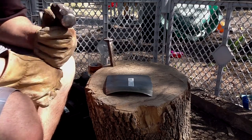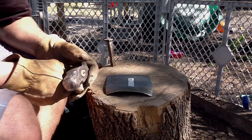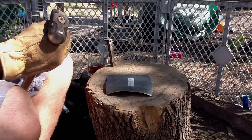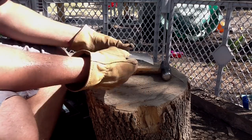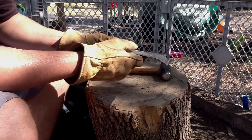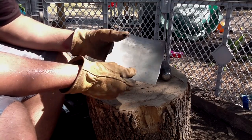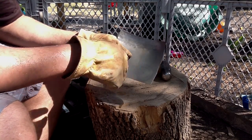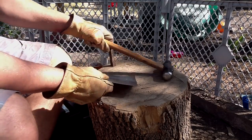The rest we'll manipulate by hand in the future, but by moving in one line down, we've made the metal curve up from the sides, creating this radius, as well as dish up and in as we push into the spot. I'm going to do the 3 circular courses here, and the metal's going to react a little bit differently than it did on the other side.